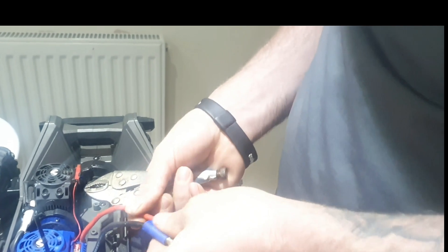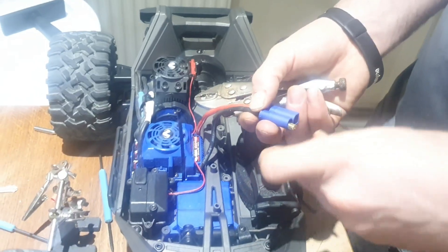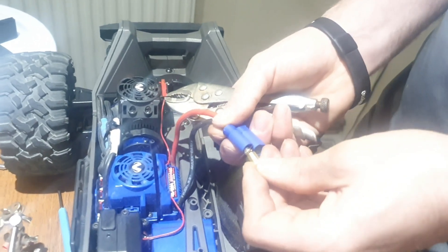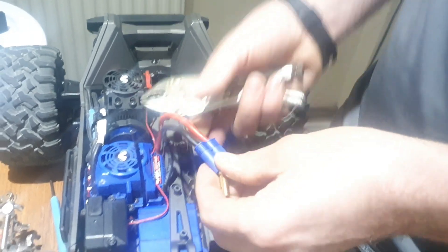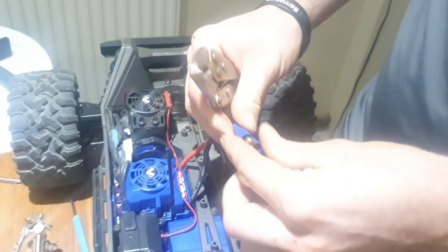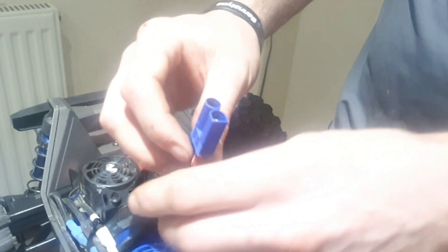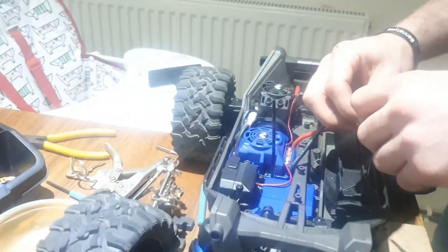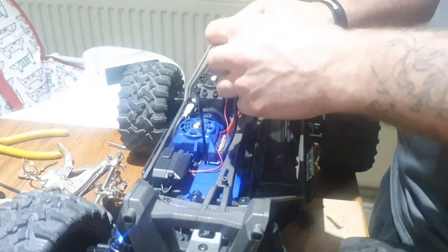That's a good thing about these connectors - they spin, so it gives you play to move about. It's not stiff like the battery ones which are fixed. Another little tip: there are split pins there. If you find that you've closed them while doing this, just get a screwdriver and open them up. If you find your batteries come disconnected while bashing, just get a pin or screwdriver in it and pop it out. But that's your end product - you've got your connectors in, it's on nice and solid, it's not going to pop off. You can put a bit of heat shrink over it if you want. You haven't lost much cable so you've still got flexibility to move it about. I hope it helps some guys out - whoever's using these connectors. Cheers.